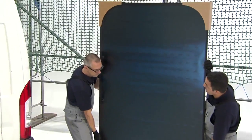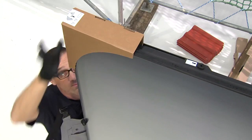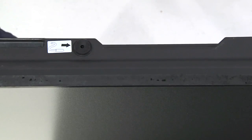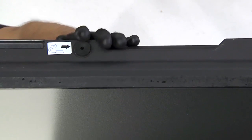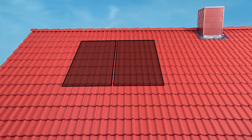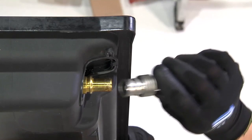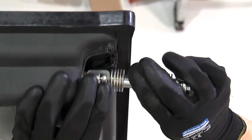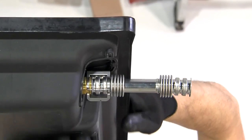You are now ready to install the collectors. You'll find all the parts needed to connect the collectors stored in the protective packaging. Make sure that the sensor lead-through for the collector sensor is at the top. Now the position of the hydraulic connections has to be determined — the return must be at the bottom, the flow at the top. Attach a corrugated pipe connector to each of the hydraulic connections and secure it with a screw clip.